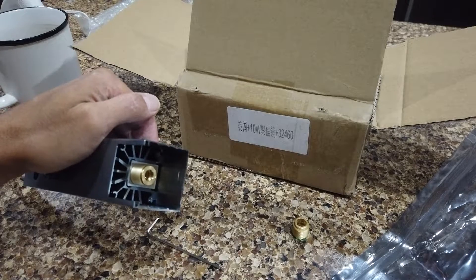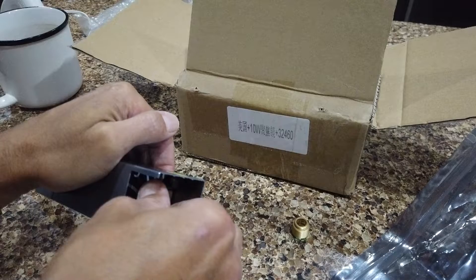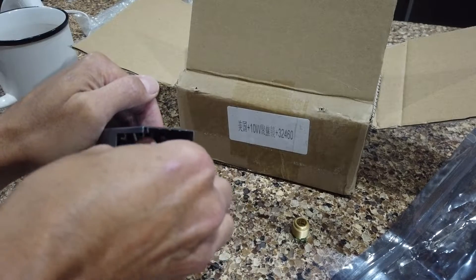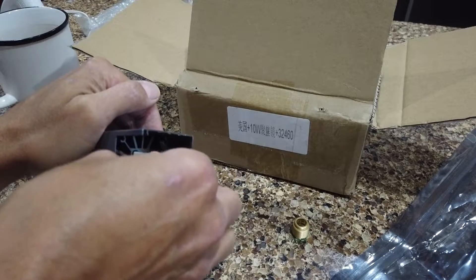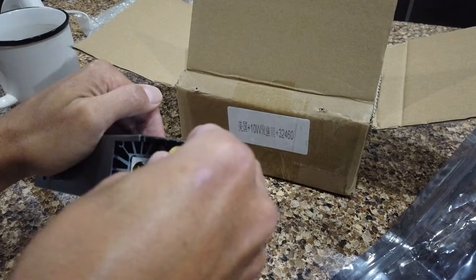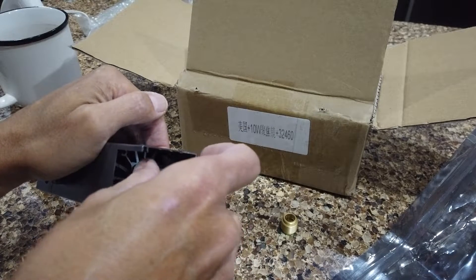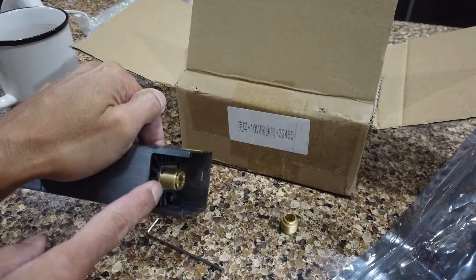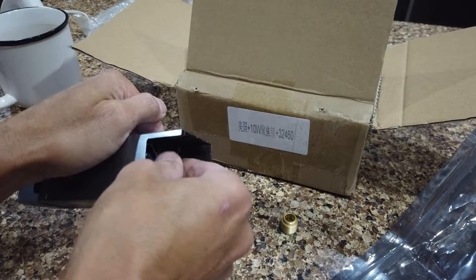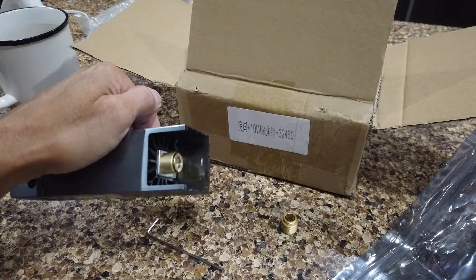If you're just changing out the window, this unscrews. But for the laser module itself — I've already replaced mine — I can't promise yours is only going to be finger tight, because mine was glued in, thus the necessity to drill it out. If you need to see that whole process, take a look at the link below. But essentially it just unscrews. You can grab your replacement and just screw that right back in. When you screw it in, the copper base should hit that aluminum silver-looking piece — there shouldn't be any gap there. If there's a gap, it's going to affect your focal length, so you want this to be tight. I'd recommend finger tight — I know this thing moves around a lot, but hopefully not enough to shake it loose.